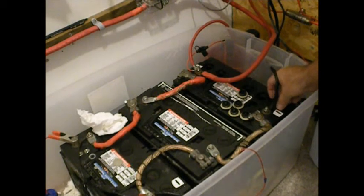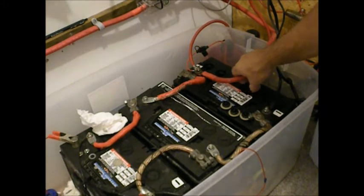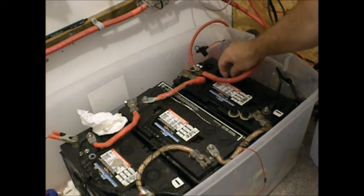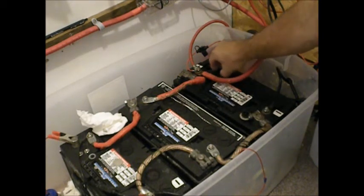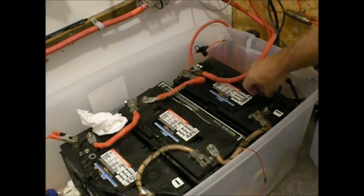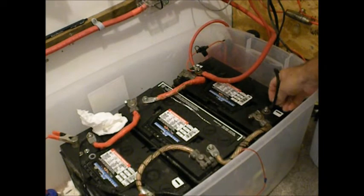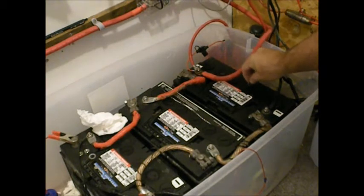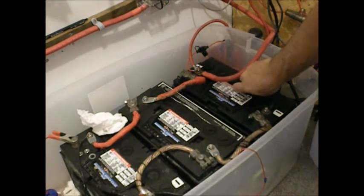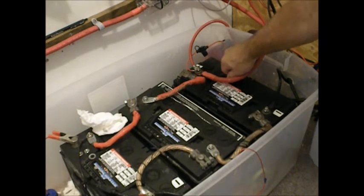When they fail, I'll go to some six-volt batteries next time. But I've got about 380 watts on the solar tracker by the street that keeps these hot. On the four big panels, which I think is about 980 watts, I made a jumper wire that I can run those solar panels — and if we had a grid-down situation, I have a battery switch on the wall. With that jumper wire I can unplug my Enphase 215s and run that roughly 980 watts of power directly into my battery bank off the tracker.